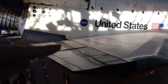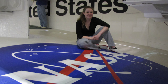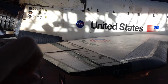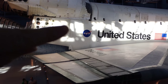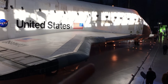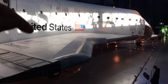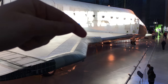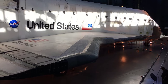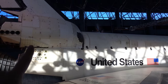I actually had to work inside one of the compartments in the wings, so I had to climb on top of it. The wing is squishy — it's not like the underside which is a hard ceramic; it's more of a felt-like material because it doesn't heat up as much. But the front of the wings heats up a lot, so that's why it has reinforced carbon carbon. We would check for damage by flashing lights on it and then using thermal cameras to watch it cool — cracks would cool differently than any part of the wing that was already solid.